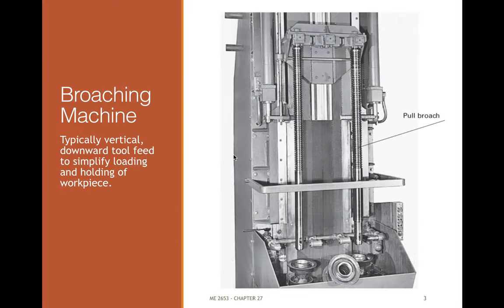It sounds like it's all upside, but the downside is the cutter. Here's a broaching machine — this is a two-head broach. You can immediately see why this is expensive: it's a very precisely made multi-tooth cutting tool that has to be made out of a good material like high speed steel and precision ground to shape. In this case we're putting splines in a little hub using a pull-through broach, where the tool gets started and then something hooks it from the bottom and pulls it through the part. The hole starts out as round and in progressive steps goes to the final spline shape. These tools are very pricey and can't really be reground once worn out.